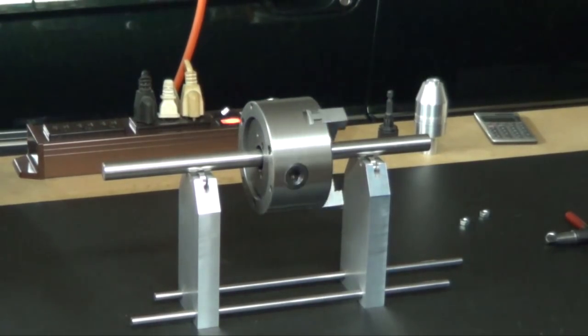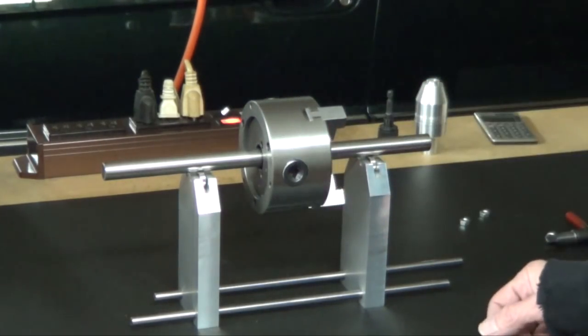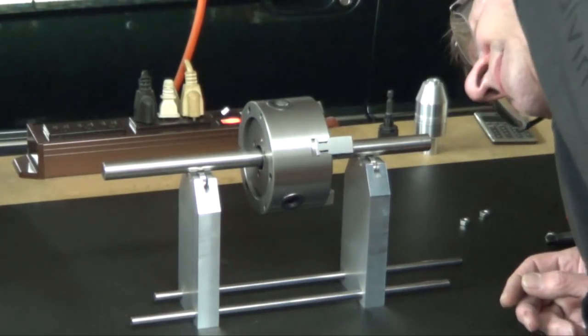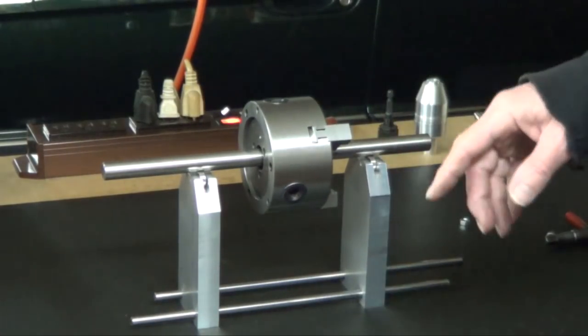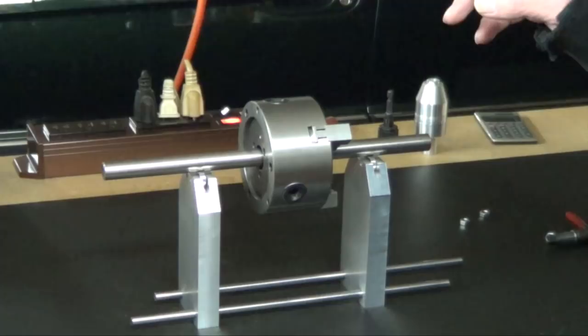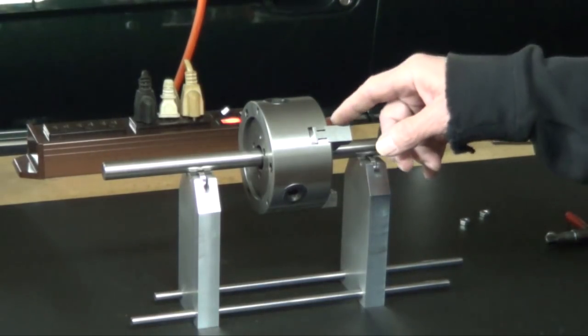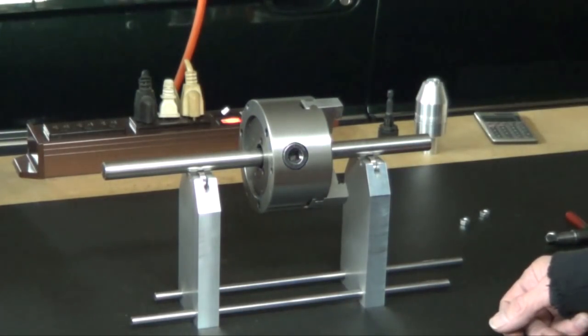The chuck itself is off. What is that? That's jaw 1. Position 1. I guess I can weigh the jaws, because I weighed the other set of jaws. 2 of them come in at 108 grams, 1 comes in at 106, and I know this thing is sensitive enough to pick that up. Look at that. Jeez. I got some work to do.